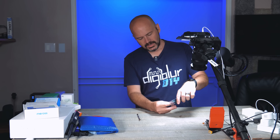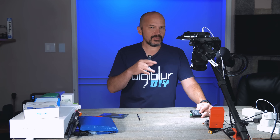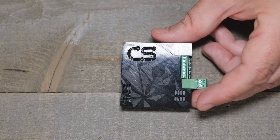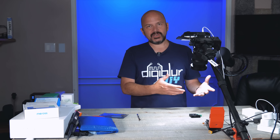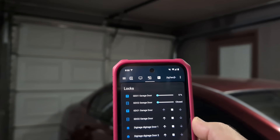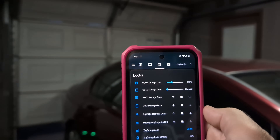Staying in line with different modules, Circuit Setup — we've had their stuff before. They had the original two-channel power monitoring, then the 6, 12, and 32 channel. I still use his power monitoring to this day and it works awesome. But he came out with something new — this cool little case using an open-source garage door library. I remember Ratgdo came out and then Connected came out with a different library that was even better, and they open-sourced it. Now he's brought it into ESPHome with this custom little module. I have one installed because I have two garage doors with that learning button — not old-school relay — and you can't do simple relay modules to push the button.